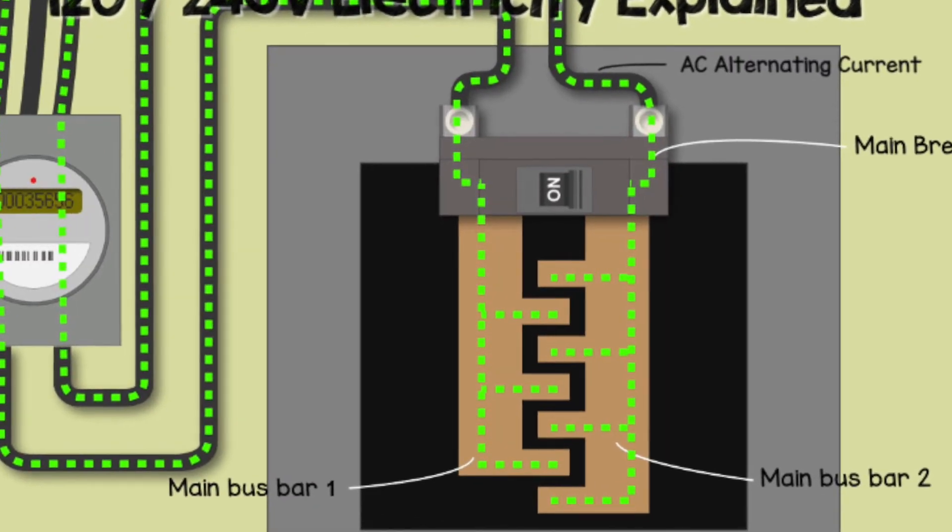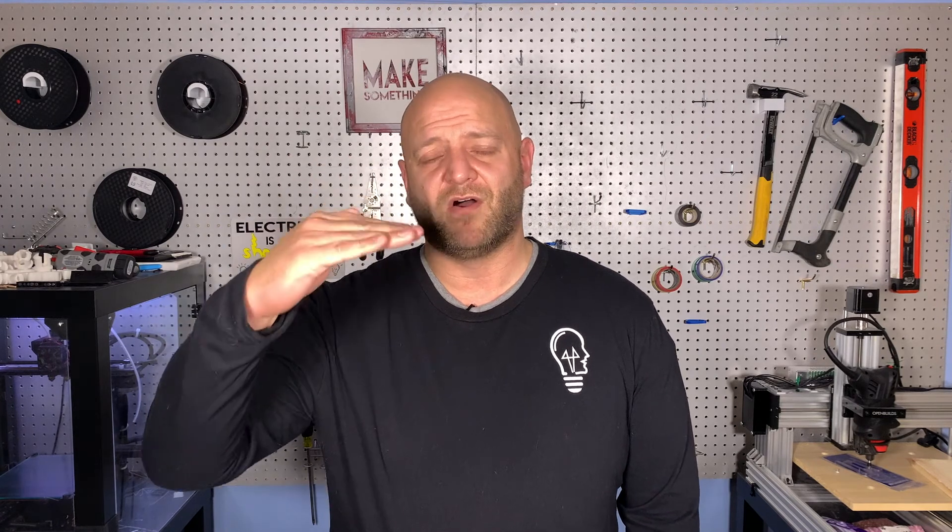So to protect your equipment, protect the utility workers, and protect yourself, make sure that the main breaker is switched off before you supply any additional power to your electrical panel. With that main breaker turned off, you can simply plug in this double-ended cable — one end into a receptacle in your home and the other end into the generator. That's going to supply power to all of the 120-volt circuits connected to that same leg of the original supply, alternating from top to bottom through your panel. In the case of a gas or oil-fired furnace, it's typically going to only use 120 volts to run the fan and some of the controls.